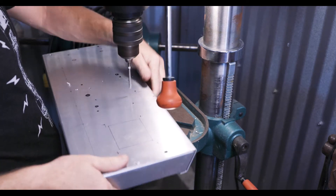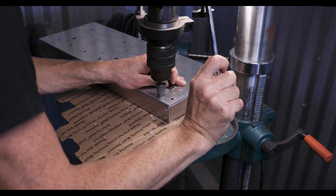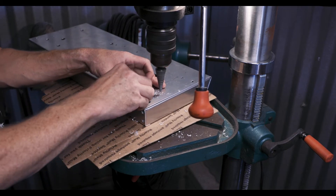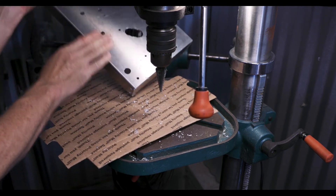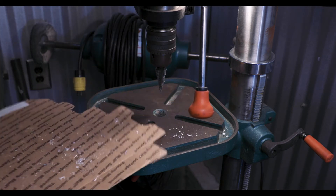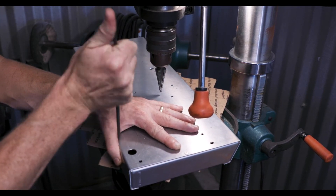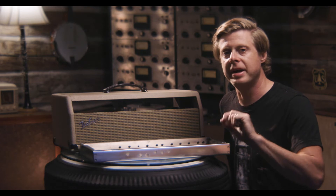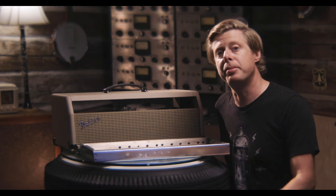First, I'm going to hit all the screw holes. Then I'm going to use a step drill bit and drill all of my pass-through holes — any place where wires from the inside of the chassis come through to the outside. In my case, I have a capacitor doghouse and I'm running leads from the capacitors in the doghouse to the other side, so I need a few holes for that, plus some holes for my output transformer. After that, I clean up any burrs on the other side. The easiest way for me is on the drill press: get my largest drill bit, line up the tip of the bit with the hole, and just barely kiss the top to deburr all the screw holes.